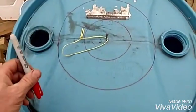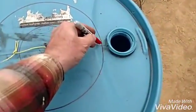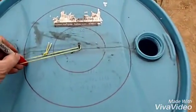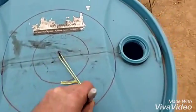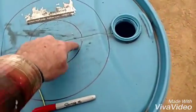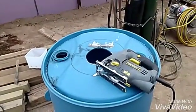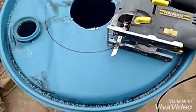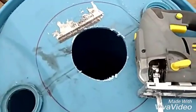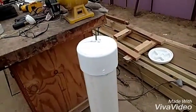To make my round cut, I just found the center and took half the distance of what I wanted of that bucket. Made me a string half that distance and just used the marker to go around and mark it. This is my smaller hole that's going to fit over that four-inch PVC pipe. For that I just used a jigsaw with a fine metal-cutting blade — that cuts through there pretty easily. Now let me put it up on the pipe and I'll show you what I've got designed for that.